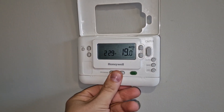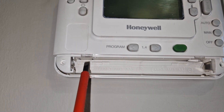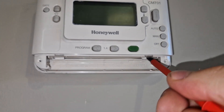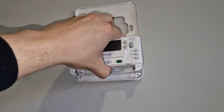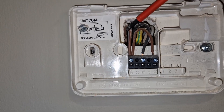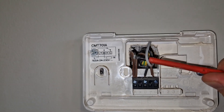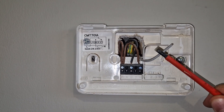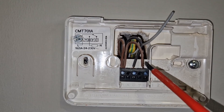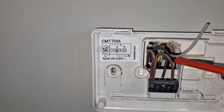The first thing I'm going to do is open it up and remove the battery. We can see an arrow pointing here with a screwdriver symbol. All we do with these is push that in like that, and do the other side as well, and they just pop out. This is where you probably want to take a photo, just so you remember if you're struggling. We can see this is live, there's no neutral here, and there is an earth behind there. We've also got a hidden wire — normally there's an extra wire if they've done it right.